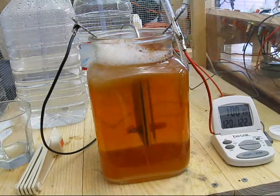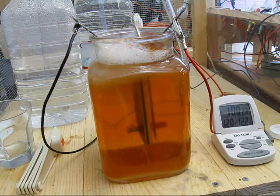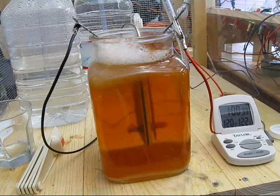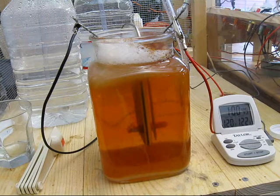At one hour I've got 120 degrees in the water, 2 amps on the ammeter. The brown particulate is still steadily increasing, and I've still got white foam on the surface. If I look at the particulate that was already on the bottom, I've got something like about 3 sixteenths of an inch.